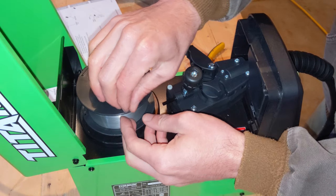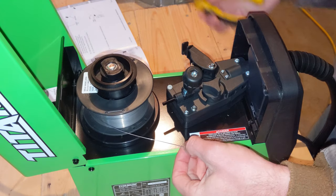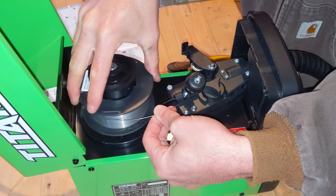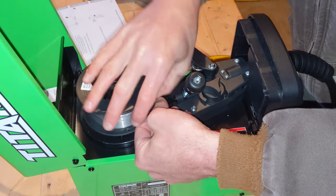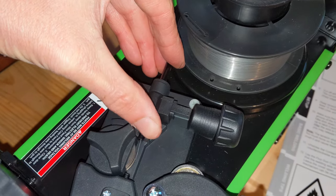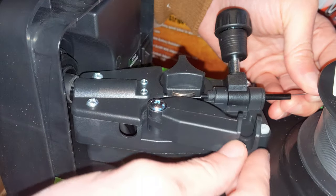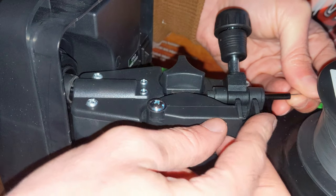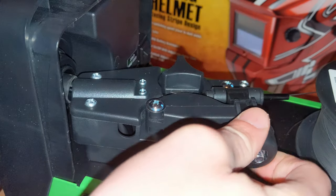Now we're going to get this wire undone. I don't want it to unravel, so I'm trying to be careful to hold onto it. I'll spin that a bit and cut this so that it's a nice smooth wire at the tip. Now I want to get this into the wire guide which is here. The wire's come out now, so I want to get this the rest of the way into that hole. It's tightened up. Now I've got to get this sealed back up - let's make sure that's in the groove. There we go. I'm going to get this locked over, tighten it down so this doesn't go anywhere. That's in there, ready to go.